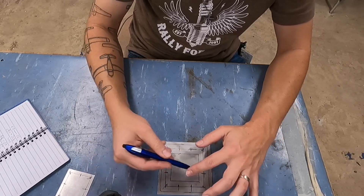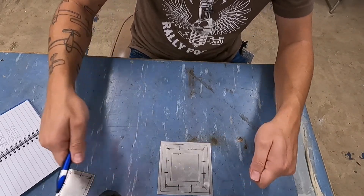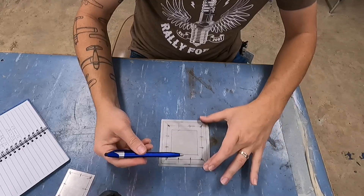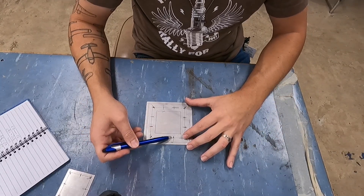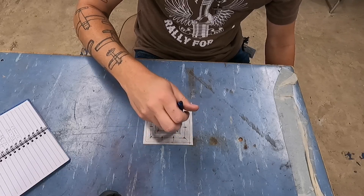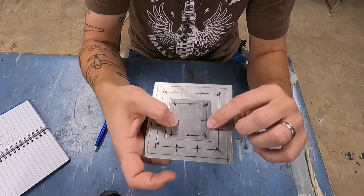One rivet at each corner. I take the fan out, lay it with just one rivet — it was past an inch and an eighth, almost at an inch and a half — so I have to use two rivets. I shrink the rivet fan until I have a hole here, two holes, and a hole here. Again I measure it with the ruler, and it fell under an inch and an eighth and over 9/32. So with this piece: one rivet here, one rivet here, two in between, one rivet here, one rivet here with one in between. This is actually a repair I would probably do on a certified aircraft. I like the way this looks — it's neat and there's not too many rivets in it.